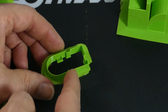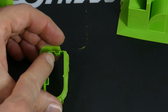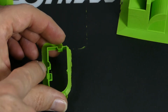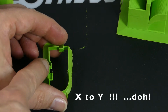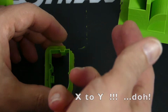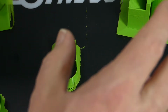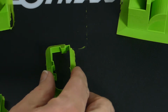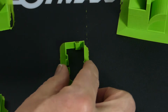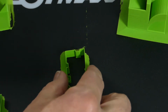What you can see is that the edges for the y-axis to x-axis movements are not as sharp as the edges for the x-axis to y-axis movements. Switching from one motor to the other has some lag because we have a certain mass that we need to move, and before it actually starts moving we have to pump a little energy into the table and then it starts moving. This makes these edges seem slightly round, and this is the case for all 3D printers, and this one is doing okay, but not great.